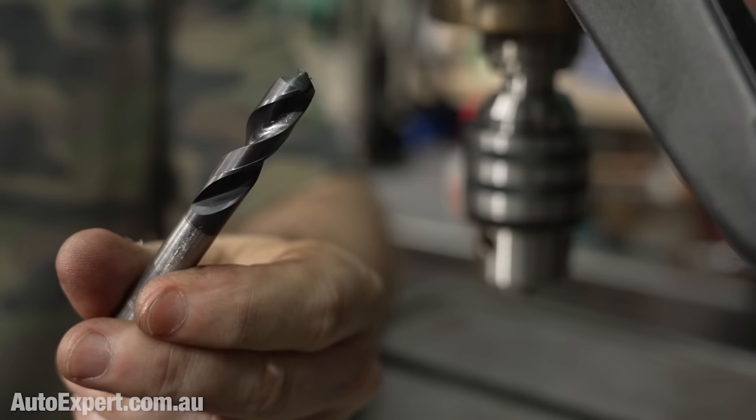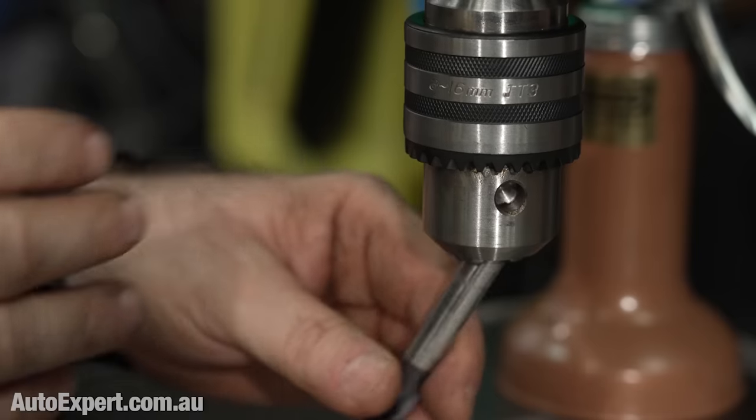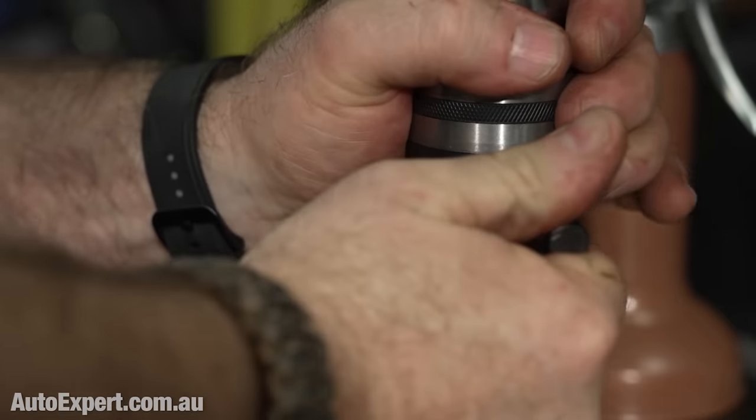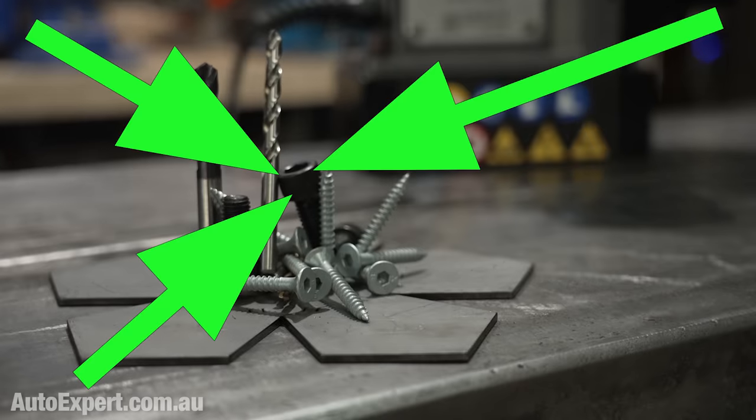If you want to do the drilling and tapping thing, a 10.2 millimetre drill is a fairly esoteric thing, at least in the context of Bunnings. So go over to Ames Industrial — I'll put a link for the drill and the tap in the description. You'll be tapping like a pro before you know it. Eight millimetres of plate thickness is going to give me more than four threads of engagement for each one of those cap screws, and I'll be using four high-tensile M12 socket head cap screws to hold the vice to the plate.